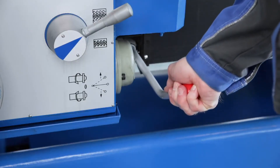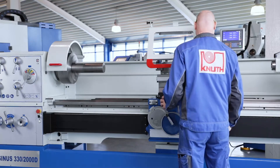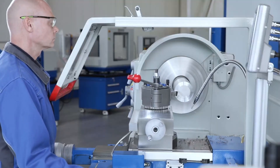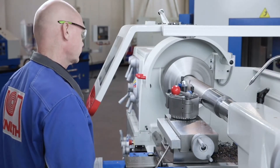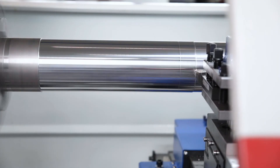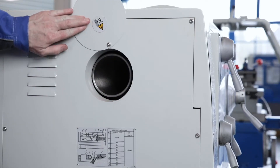The operator can adjust the acceleration of the main spindle, whereby the alignment of the workpiece in the chuck is maintained. All gear wheels and gear shafts are hardened and ground for increased durability. The main spindle and main gear are lubricated by a powerful oil pump, guaranteeing optimal lubrication and cooling of all gear components. The large spindle bore enables the short clamping of shafts and tubes up to a diameter of 105 millimeters.